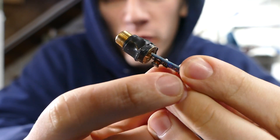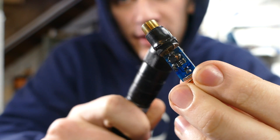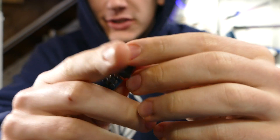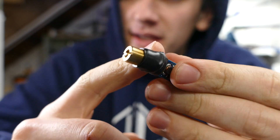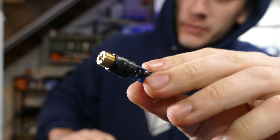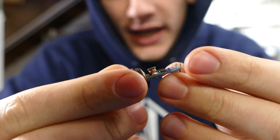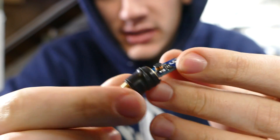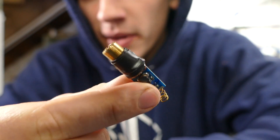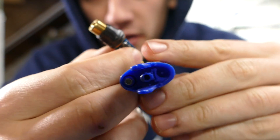I was able to remove the laser diode from the laser. This other one here is what's left of the original laser. We got out the laser diode. One thing I did was tape on the focusing piece, because without it the beam is just super dispersed — like a flashlight — and it's not going to be able to burn anything. I actually accidentally disconnected one of the leads so I had to re-solder that, which is why it looks a little messed up, but it still works. Now we have to figure out a way to cram it inside of this lighter.